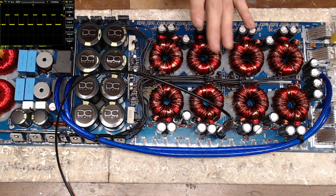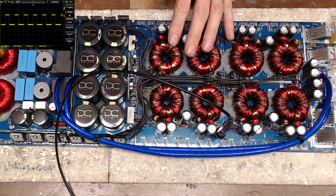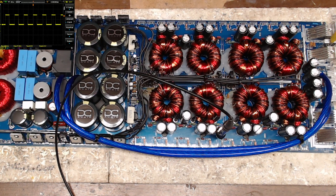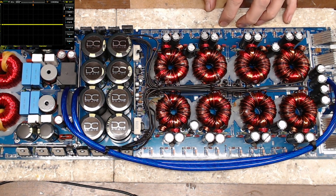There are 47-ohm gate resistors, so we'll get those installed. Then I'm going to fire up the desoldering gun — the Hakko — and pull the rest of the output transistors just to be on the safe side. We'll fire up the output section and make sure we have good low-side drive coming off the 21844s. We'll get the gate drive resistors in, get the 3205s put in the power supply, remove the output transistors, and fire this up again.